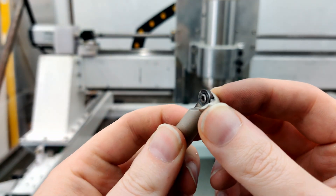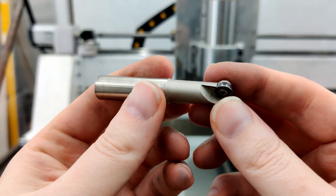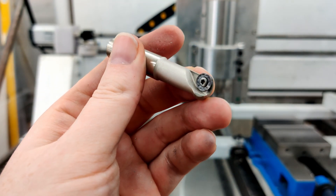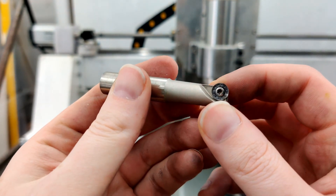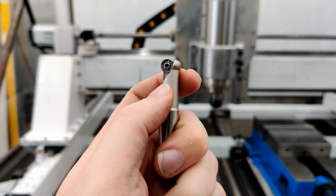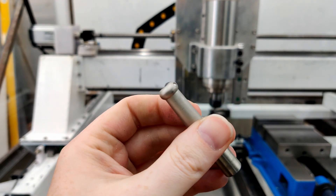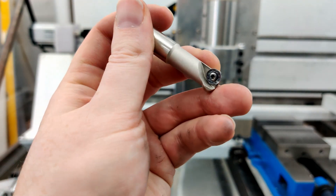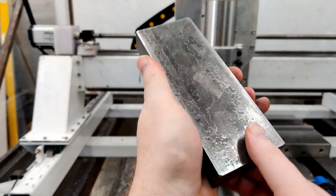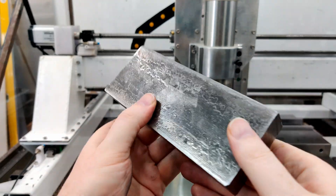There's nothing on it — not broken, not chipped, not visibly worn. I have some other tooling coming: a BAP 300R and a smaller one that uses JDMT inserts. The BAP I have is 12 millimeters and the new one is eight millimeters, so that'll be interesting to try. I also got PCD and CBN inserts. Looking at this bar, it totally looks like Beskar material from the Mandalorian — could probably sell it to Star Wars fans.